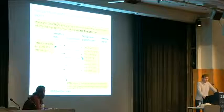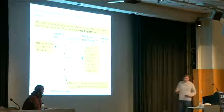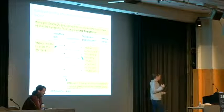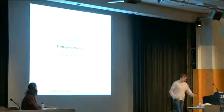So good so far. So Dexter is now going to explain how this putting needles on the chip business actually works and what tools are involved in that. The attack he's describing is slightly different in that we don't actually have to tap the data bus and all that on the chip he chose as an example, but the same principle applies. You override a bit, in this case a fuse bit, and the chip loses its protection capabilities. Right?